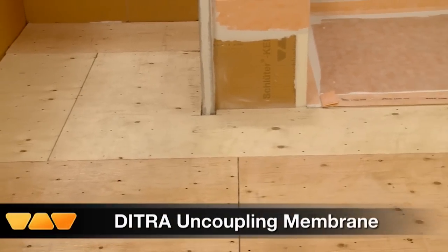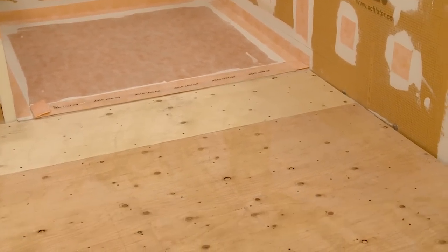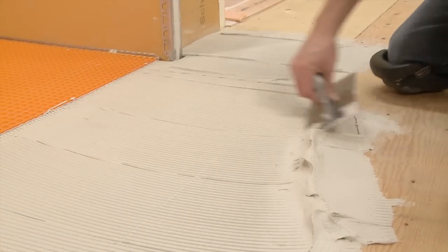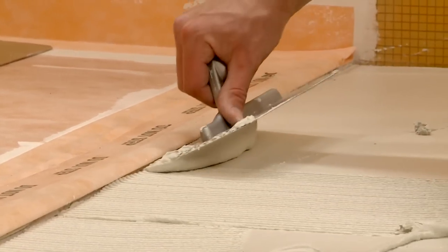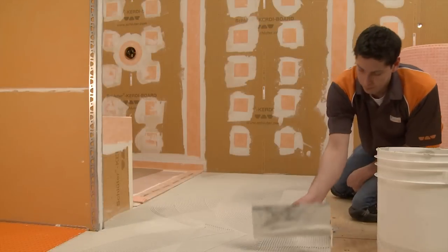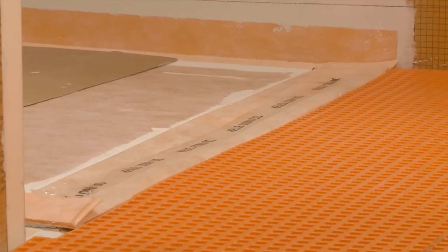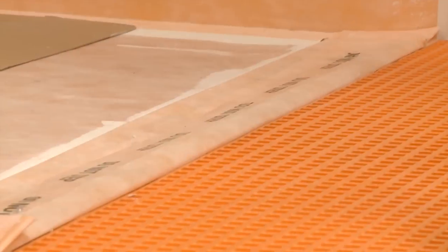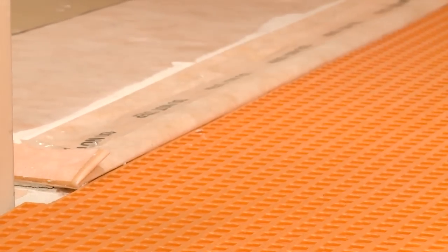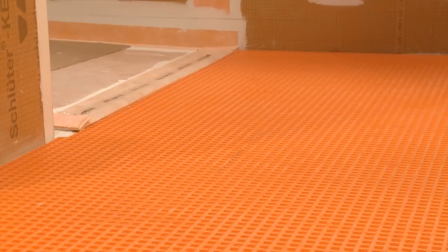We're going to use 3/4 inch plywood and Ditra-XL to raise our floor flush to the channel body. Schluter-DITRA is an uncoupling membrane that is designed to allow the installation of ceramic and stone tile over any even and load-bearing substrate. Schluter-DITRA not only offers uncoupling, but waterproofing as well. This is essential in applications such as barrier-free bathrooms where moisture can be expected outside of the shower area. Now our floor is flush with our channel body and we are ready to complete the waterproofing.